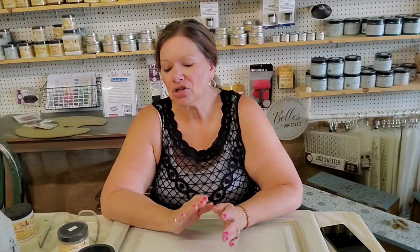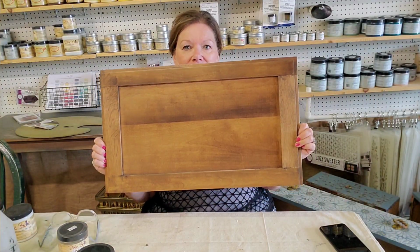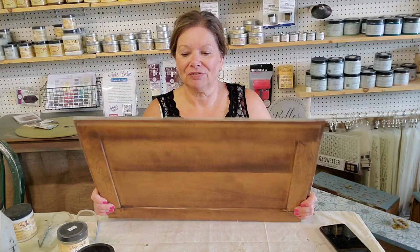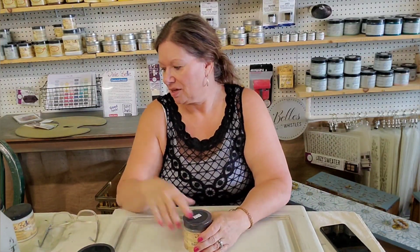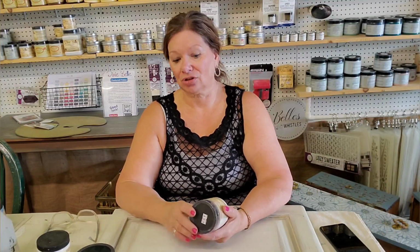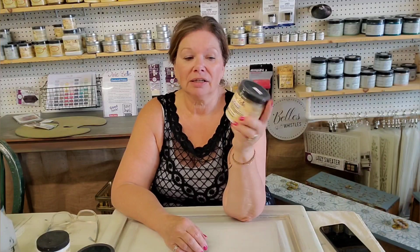Okay, let's roll back to primer. Let's say the cabinets that you're painting are raw wood. Different kinds of wood are known as bleeders. So if you or your client want white paint, there's Cotton, that's Dixie Belle's Whitest White, or it's White Cap in the Silk line. Even though the Silk paint has a built-in stain blocking primer, you need more. If you are cleaning the wood and it comes off brown and they aren't smokers, then you know that that's a bleeder. So you need an extra stain blocking primer, which Boss is what I like to use.